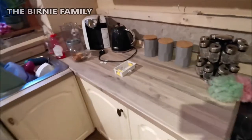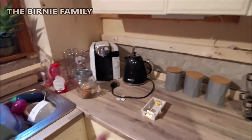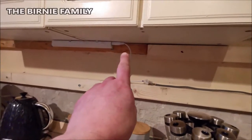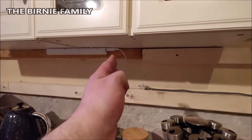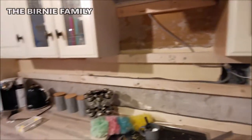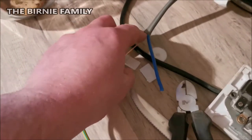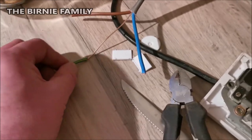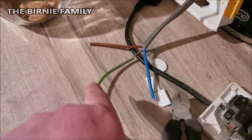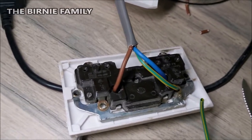Just bringing it up to another step now — over here is where we really want all the bits and pieces for coffee and whatnot, so we're running a cable across the back to give that some power. To finish off the lights, we're going to have to cut a little channel out with the drill and chisel just to bring that down, because when the tongue and groove goes on we'll need the wires behind it. Generally with three-core — just like I showed you — that's live, neutral, and that's the earth. You can cut that away if it's just two-core.